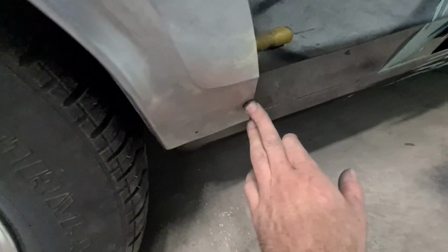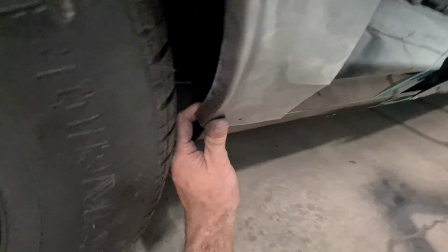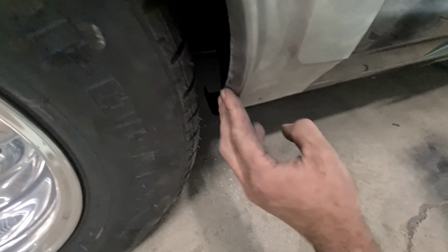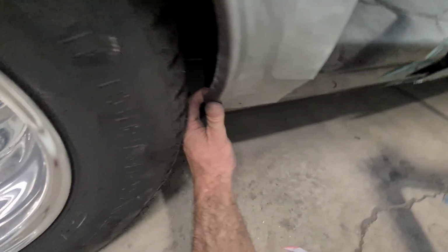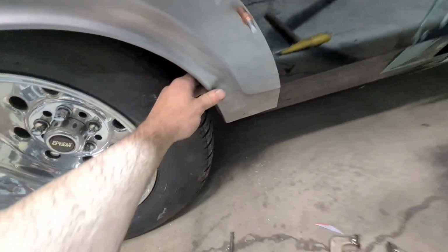Now we can see this area will meet up with a bit of pressure, but it forces the arch off. So if we want the arch to meet, it puts this area back off. It's telling me that it still needs to be stretched around a touch more. It's splaying this way too much, so play with that a bit more and stretch the arch in both ends, and we'll see how we can get it sitting.